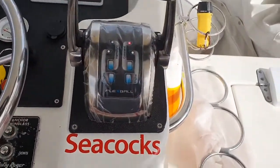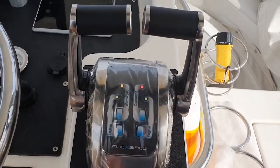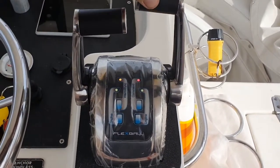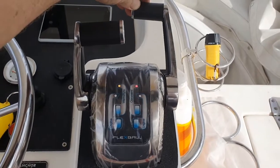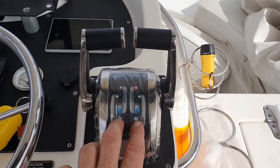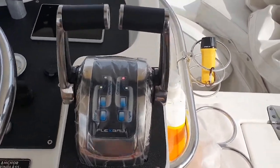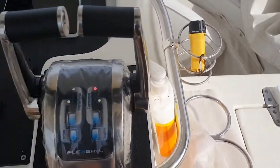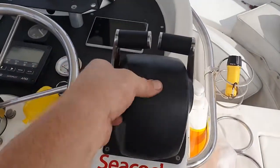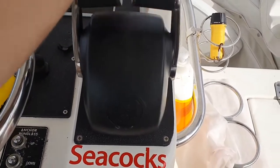The great thing about the EM system is you can hold down these two buttons and all of a sudden the yellow light goes solid. This means that both engines are operated off the one throttle lever, and therefore your engine RPM is exactly in sync. Very simple to use, very reliable, IP68 rated, so great on any form of deck. They also come with a nice water-protective cover over the top that snaps down, to keep them even more protected when not being used.